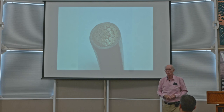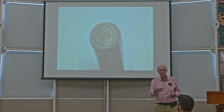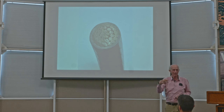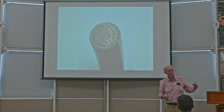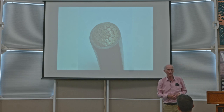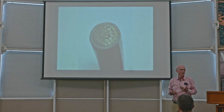Okay, so what we did is we put a solid copper bar through the wall, which was sealed. We brought the electrical cable to one end of the copper bar and connected it, and at the other end of the copper bar inside Biosphere 2 connected another electrical cable and continued, and that way we were able to seal the electrical penetration so that there wouldn't be any air leakage just because the penetration existed. Next slide.